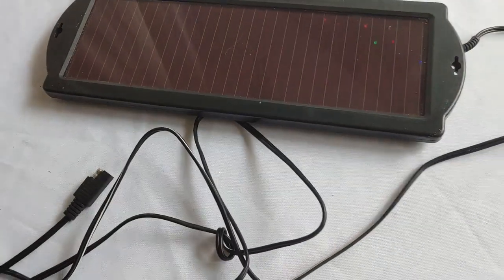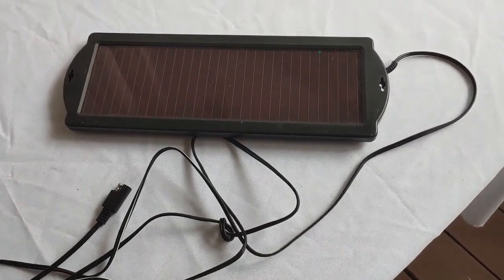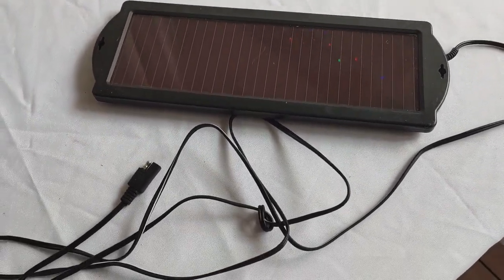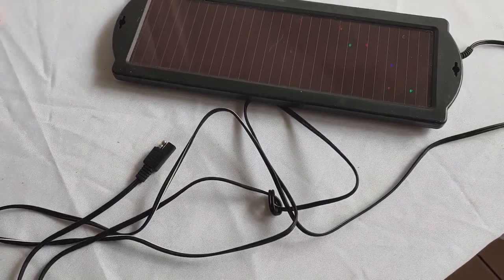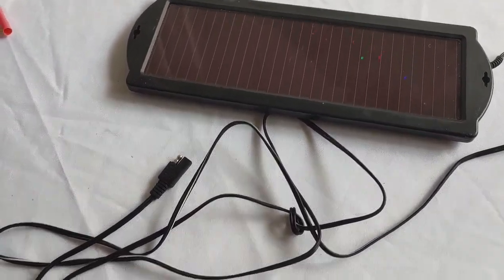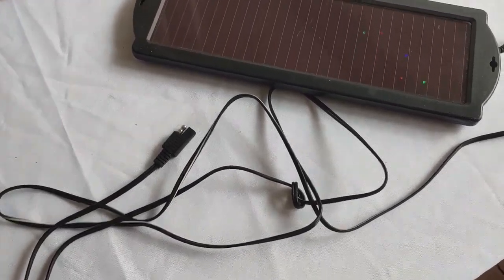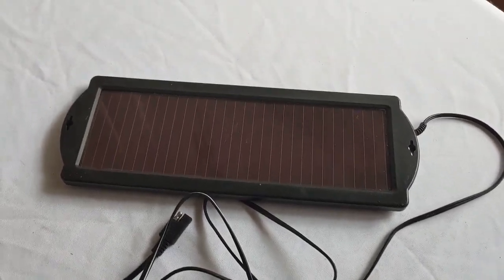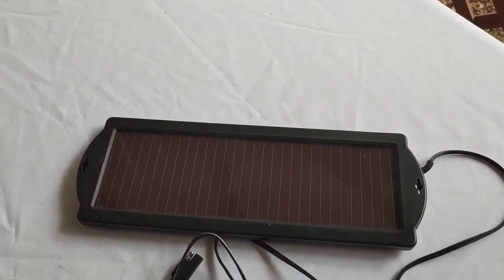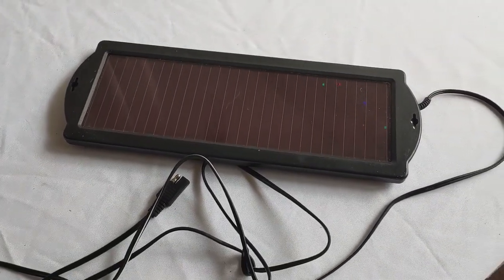Remember, it's only a 1.5 watt, and it's not going to totally charge up a battery once you drain it. This is specifically for trickle charging — keeping batteries charged up that you don't use a lot, or that has a very slow drain. But it's small, so it's easy to take this, set it outside in the sun, hook it up to your battery, and it stays out of the way.